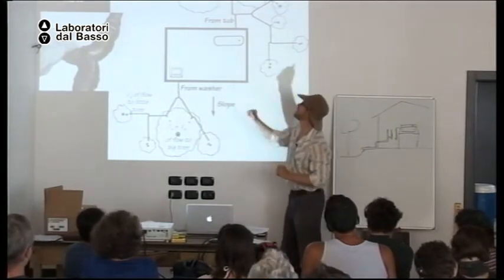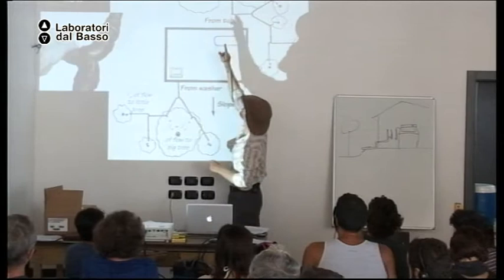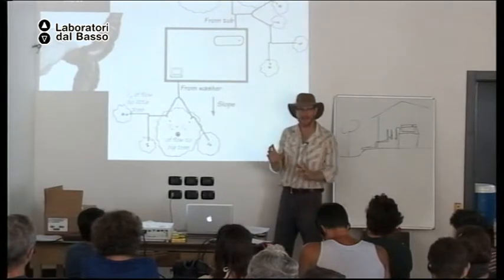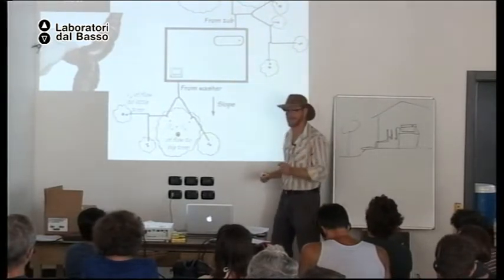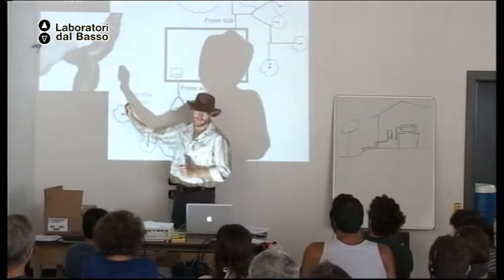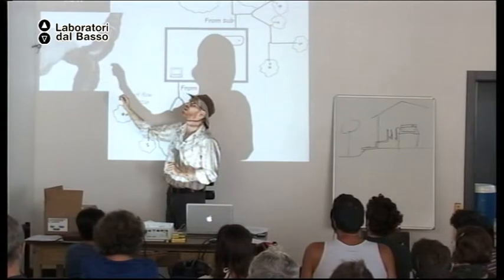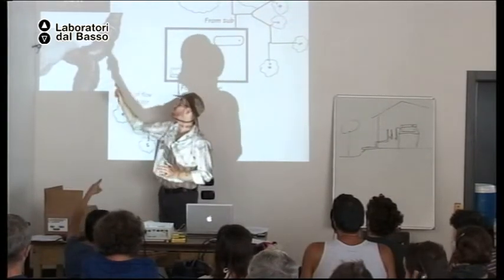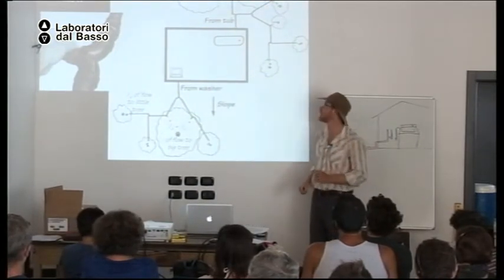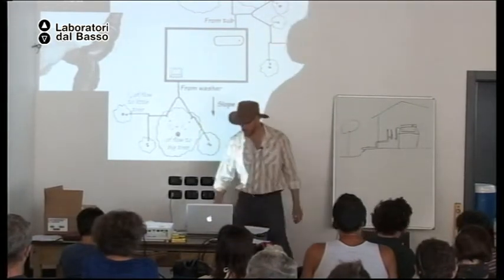Okay? So then when I come to my first flow splitter, this is a flow splitter. It's a T that directs the water two ways. Then I can get a reducing T, okay, which goes from 50 millimeters to, I guess it would be 30 millimeters. Okay? And it works good.